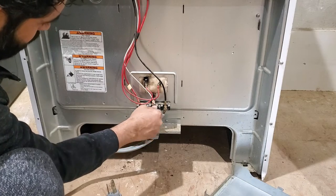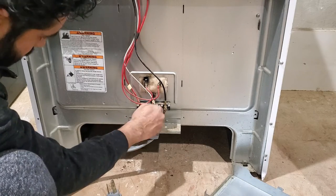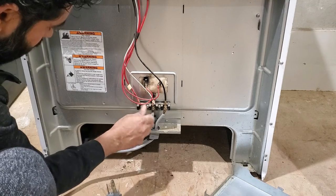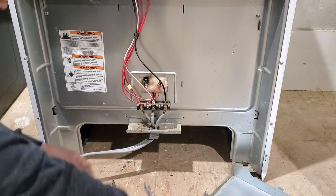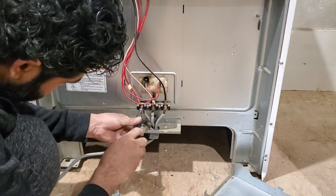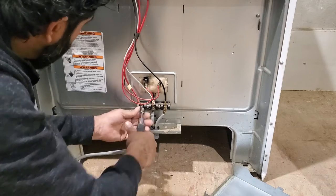If you don't have them and you use wire to just make a hook, it's not going to make a good connection. Over time, the connection is going to burn or get hot. So I would say, get those crimping connectors and use them — it's really good, safe to work with, and easy to work.